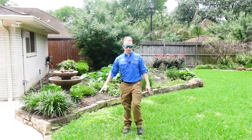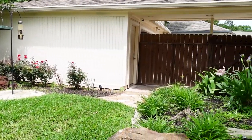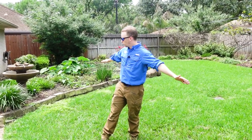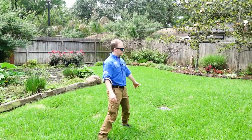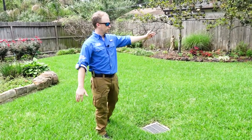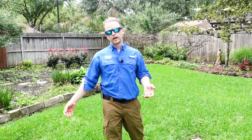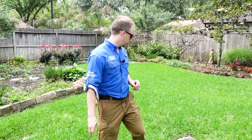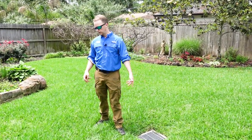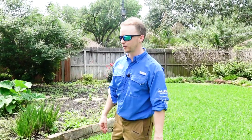On the back side of the property we have a really funky but beautiful yard — they did a really good job, but you can see there are several low spots and you need to consider how water is traveling through the backyard. The first thing you notice is they added a French drain or surface drain system to take all excessive water away, which is great. If you have standing water in these drains, throw in some chlorine tablets or bleach to help keep the mosquito population down, because mosquitoes love that standing water.